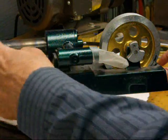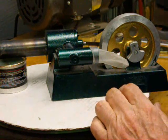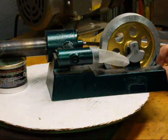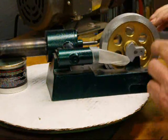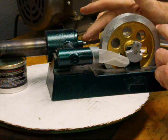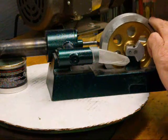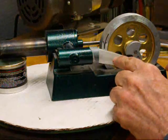The engine is heated up now by this fuel — you can use any kind of fuel, but I find the Sterno here is real convenient. It's been preheated a little bit. I've taken the piston out and over the end of the power cylinder I've placed a finger out of a pair of gloves. As I rotate the flywheel, you notice that the balloon — we'll call it — inflates and deflates. As the displacer moves to this end, it moves the hot air to the cold end and it's contracting. As I rotate and the displacer comes to the back end, all the air is up here where it's hot and it's expanding and filling the balloon.